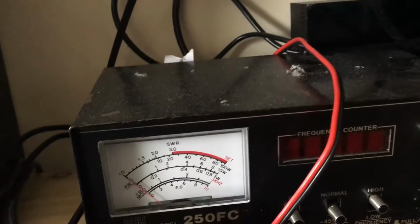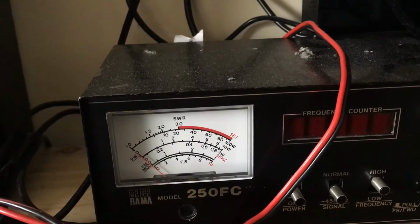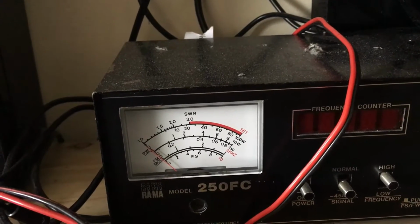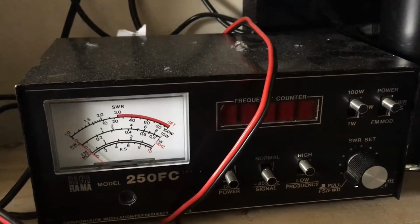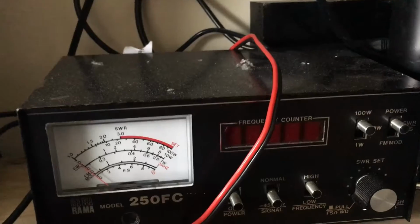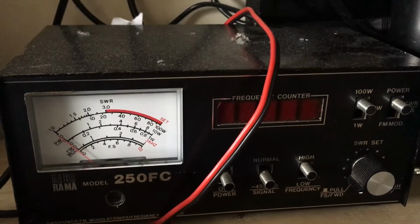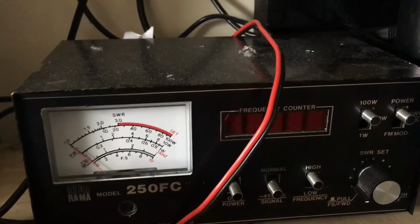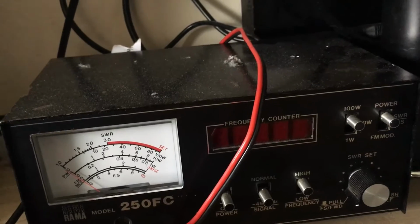This has now been adjusted, so for a known voltage of whatever it is, I forget off the top of my head, RF voltage at peak, this now reads the wattage, and it kind of corresponds with the 6900N as being 35 watts max power output, which if you've used it for a short period of time seems to fade off on this 6900N. I don't think it's overly stable, but I'm quite happy that the ballpark figure on this is reasonably good.